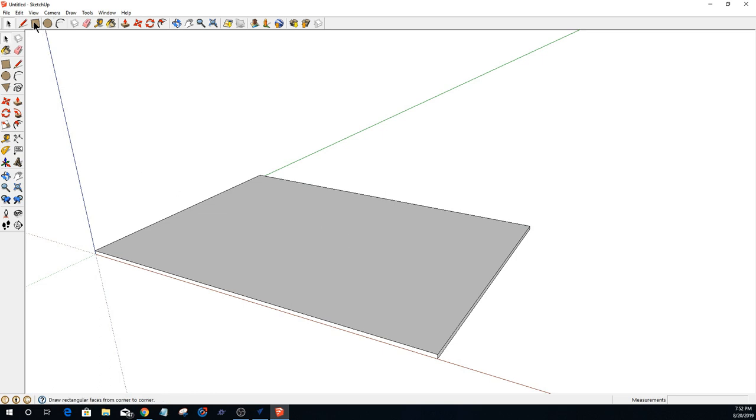But let's get my divider boards in. The material I'm going to use, I'm going to plane it down to half inch thick, just like cabinet material. So we're going to enter, and we're going to pull this up. All right, so I've got a half inch base, and my drawer is 4 inches. I'm going to go 2.5.